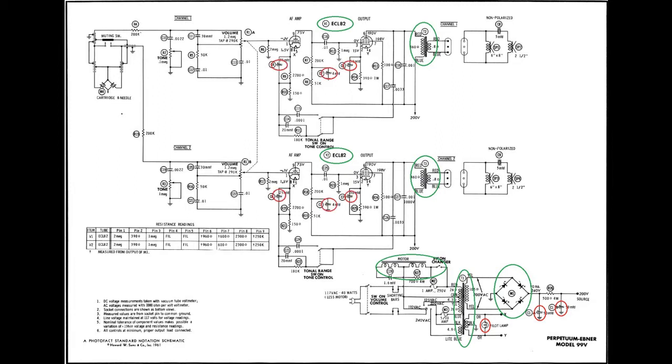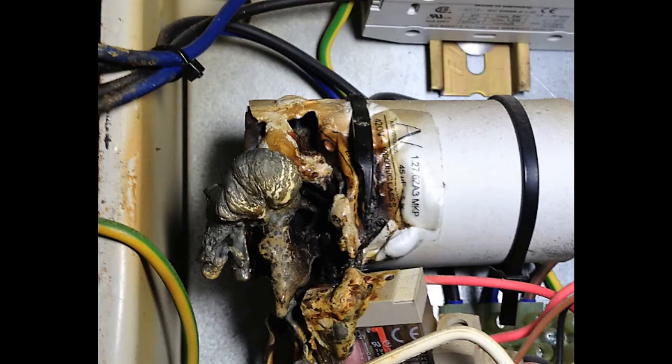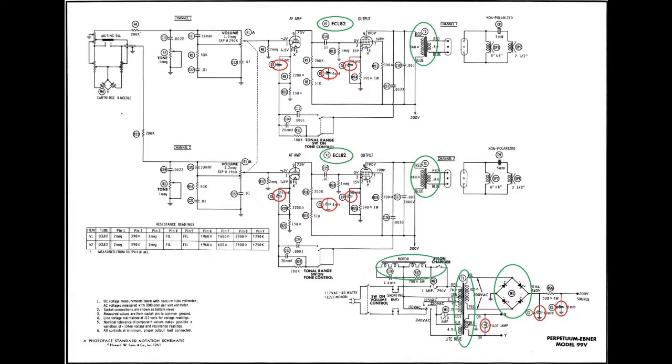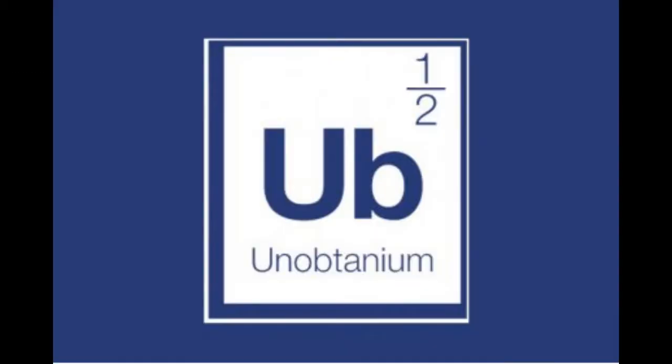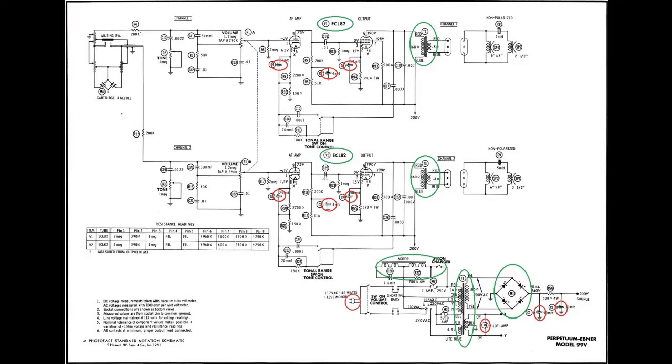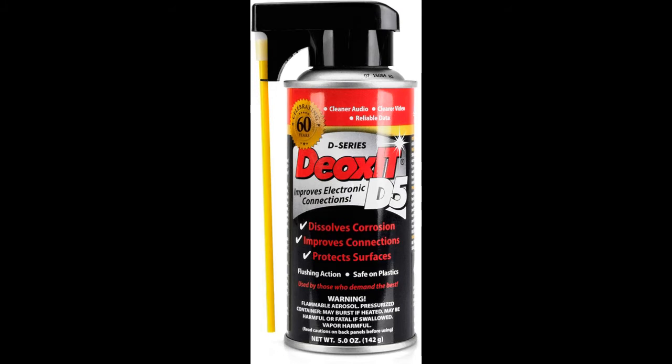Though I didn't see any visible signs of damage or leaking on the smaller electrolytics, I really don't see how they could have survived if the big one was decaying. I could try to reform them once I get them out, but there's no way for them to vent — not a mess you want in your lap — so I think I might as well replace those as well. I'll definitely have to swap out that two-pronged plug for a three-pronged, just to be on the safe side. The tone parts were fine, as were their switches. The on/off switch and volume control were okay but seemed a little sticky — I'll have to give them all a good cleaning with some DeOxit when the time comes.